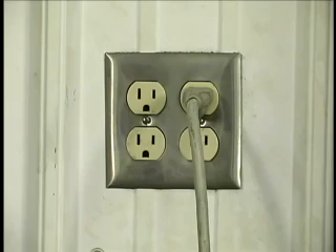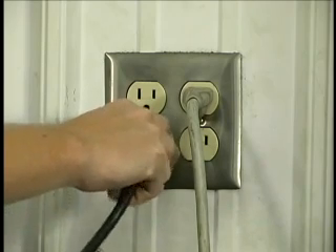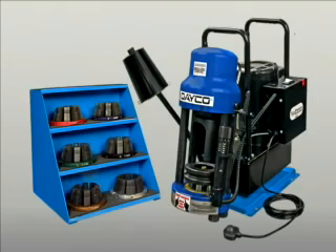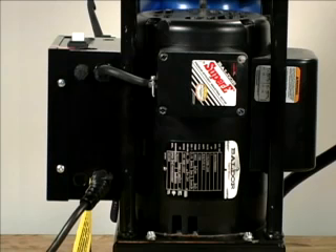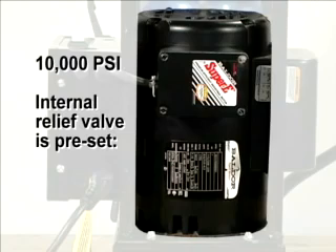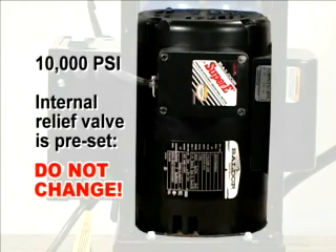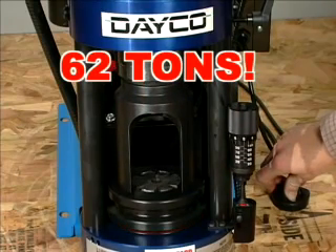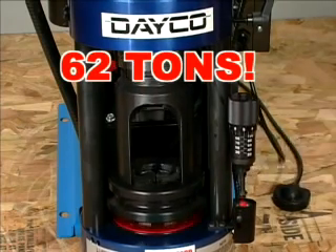Position the machine close to an electrical outlet so that it can be plugged in without using an extension cord. The D165DC comes fully assembled, calibrated, and ready to use. The hydraulic pump has a maximum output of 10,000 PSI, so be careful around the machine and respect this power. The internal relief valve is set at the factory — don't change it. The ram moves down with a force of 62 tons, so be extremely careful not to put foreign objects in its way.